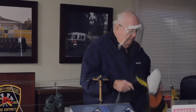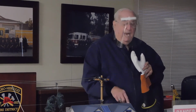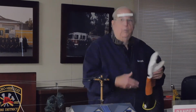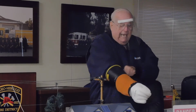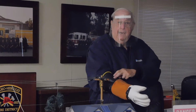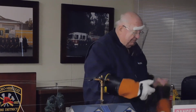And what we do, we put on these leather protectors after we do the checking. And by the way, that check is not only on one side, we turn the glove inside out and fill it with water and do the same process as the first time. And with these protectors, we put it on the glove, and all of a sudden, this glove is protecting that rubber glove, and the rubber glove is saving our lives. And that's just that simple.